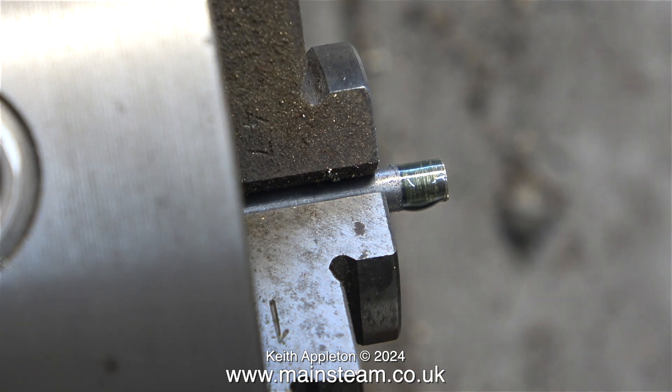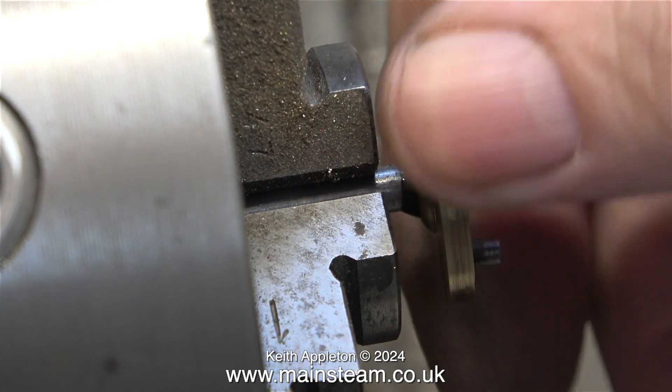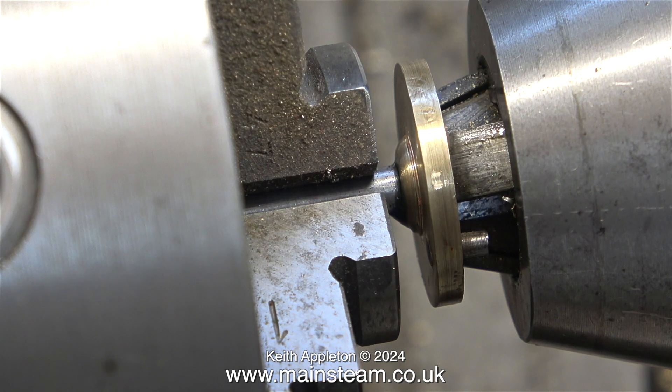I've made it very obvious in this clip that the crank web is not a tight fit on the crankshaft — you always have to leave a small clearance for the 603 to do its job. Because the very last part of the crankshaft is an interference fit, I'm using the tailstock chuck to push the crank web all the way onto the end of the crankshaft. I left it like this for about 20 minutes to give the Loctite some time to cure.